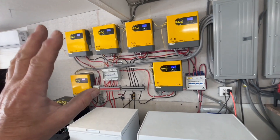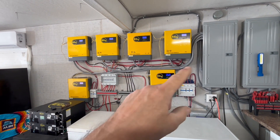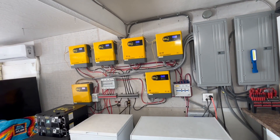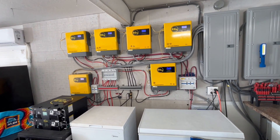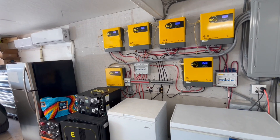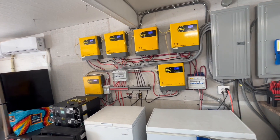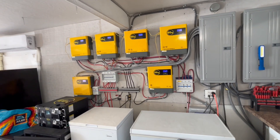I'm really never going to use 18 kilowatts, but to run my pool and keep these inverters at around 30 to 40 percent output is better than running four of them at full bore producing around 2,800 to 3,000 watts each. Running them at half load means they'll last longer under that heavy pool heating demand. My regular usage — three and a half ton and four ton air conditioners plus an 18,000 BTU mini split — might use about 7,000 watts. Divided across six inverters, that's not even 1,200 watts out of a 3,000 watt output — only about one third.